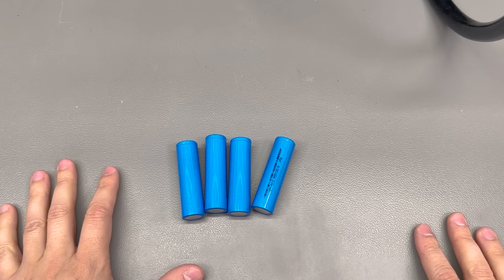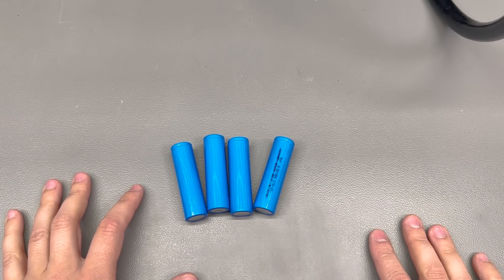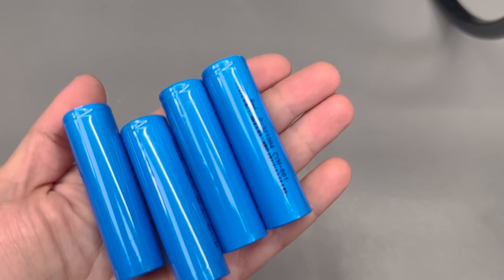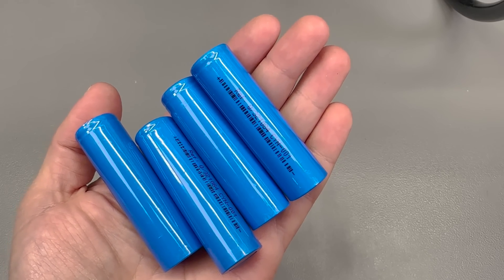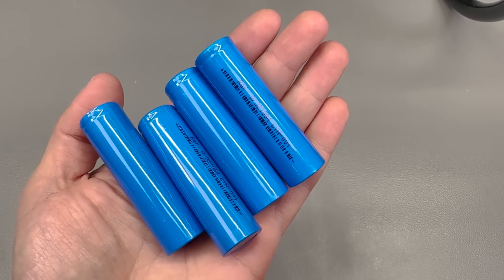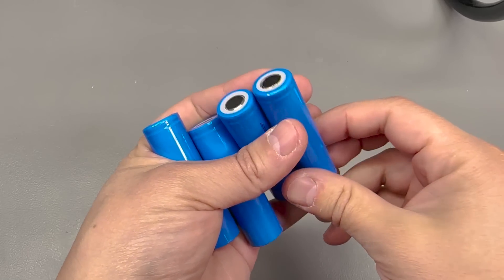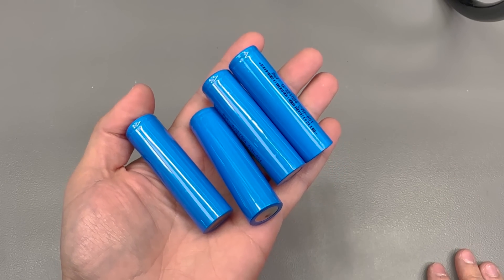The final item in this video is these 18650 sodium-ion batteries, which took about 8 weeks to be delivered. If you're not familiar, these use sodium instead of lithium, making them cheaper and safer than their lithium counterparts — though right now they're actually more expensive than 18650 lithium-ion cells due to lack of economy of scale, so they sell at a premium through resale channels like AliExpress. They should be safer, less prone to fire or explosion, and should have a longer cycle life.